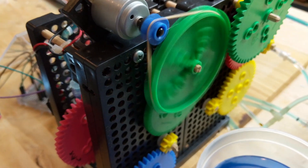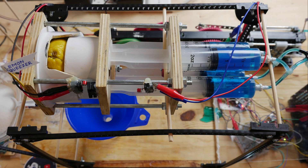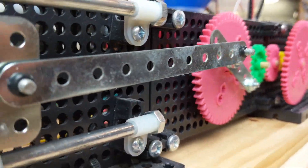When it came time to programming the microcontroller it was really helpful to think about it as if you were telling it what to do in English. So when you push this button you want the valves to rotate to the crush position, then you want the pump to turn on. The pump runs until the crusher makes it all the way to the bottom limit switch, then the pump stops, the valves turn to retract, the pump turns back on and continues to pump until it's fully retracted, and then it stops and waits for you to push the button again. That's what the program does, but in order to do that you've got to speak to it in computer language.